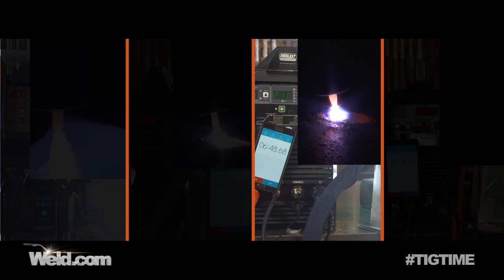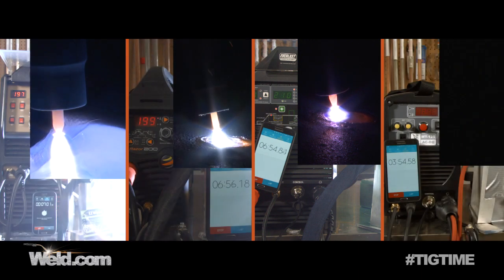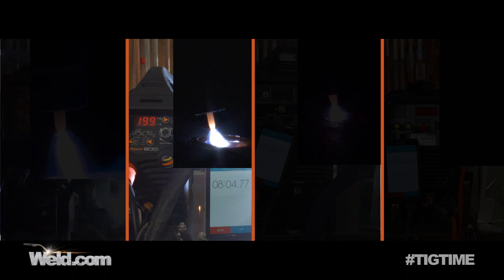Just want to note that I'm still using a 1/8 inch diameter tungsten. At eight minutes, the torch is hot and actually starting to smoke a little — there's a lot of radiant heat. We've now exceeded eight minutes and you can see some little sparklies — those are just impurities in the metal coming out. It's arcing straight into steel, with a steel backup.